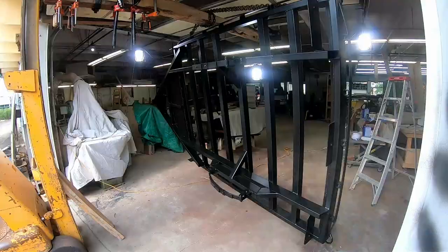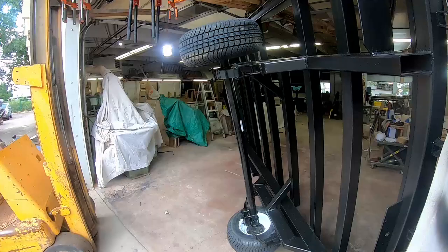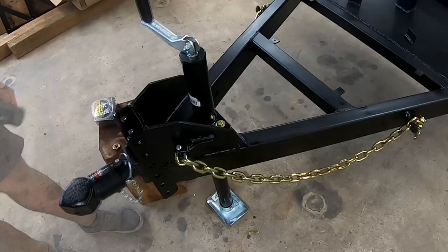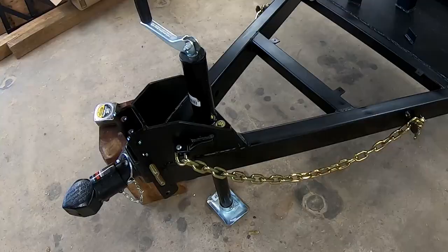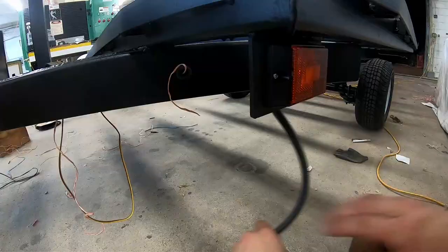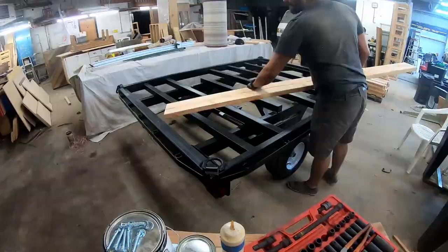You may want to think twice before strapping a cedar post to your forklift tine to flip this giant heavy frame. I coated everything with rusty metal primer and then tractor supply black farm implement paint. What was nice about having the tube frame is that I could run all the wires inside the tubes and they just poked out with a little loom — that seemed a lot cleaner. So there's just a bunch of fiddling with the wiring to get everything tightened up and then all the little accessories could be mounted.